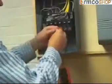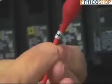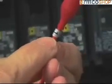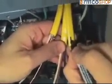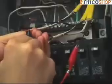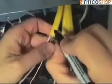The polarity feature can be used to identify multiple cables. We will use three Romex cables to demonstrate this feature. We will connect the red test lead to the ground wire in the first cable. Notice that the red lead has a wire marker labeled number 1 — we will label this cable number 1. Now we will connect the black lead to the ground wire in the second cable. Notice that the black lead is labeled number 2. We will mark this cable number 2.